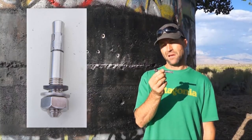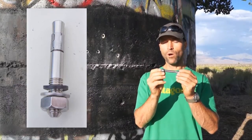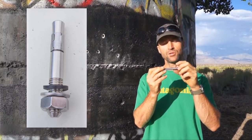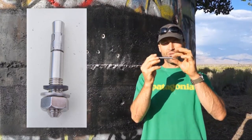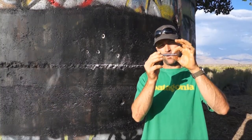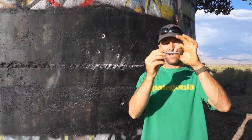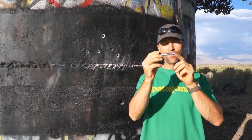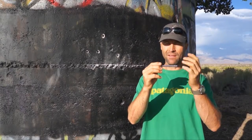It's stainless steel. It involves a threaded stainless rod stock with a taper on the other end, and a two-piece sleeve that kind of floats on that taper. As this is driven into the hole, the dimples on this sleeve are what make contact with the hole and stay in place. So we drive this into the hole, and as we tighten down the nut, it draws the stud out of the hole. These sleeves actually expand as the taper pushes them against the sides of the hole. It's a pretty simple, standard design — that's one of the things I like about it, the simplicity.